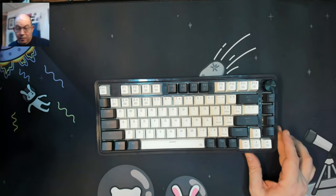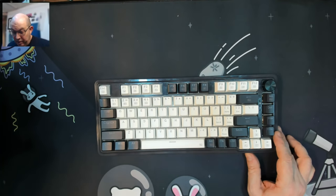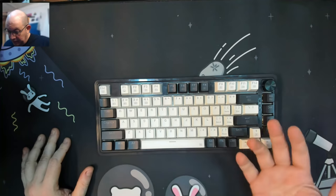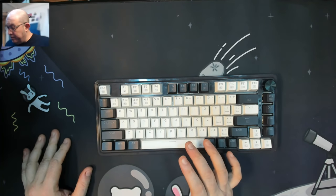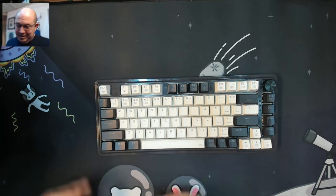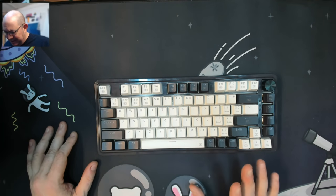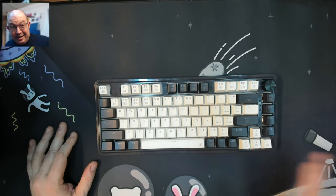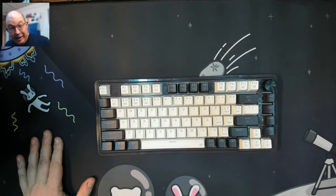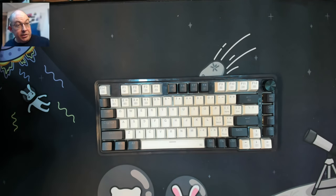All right, so now we're going to do another sound test. We have lubed Redragon Reds. They're not the exact same, but they're close enough to what came on here, but we replaced them with lubed switches. We've done one layer of Tempest tape to the back of the PCB very carefully because there's a lot of little things to deal with there, but I think that's enough. We have put a layer of PE foam as well as a layer of PET plastic. We're using a Ziploc bag here, but the PET plastic is above the PCB with the PE foam being above that. So let me do a sound test and we'll come back, and then I'm going to replace the switches and the keycaps for one final sound test. All right.